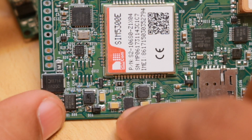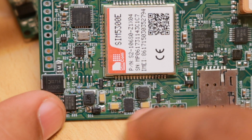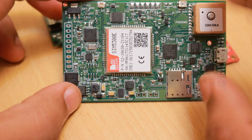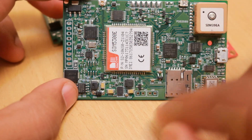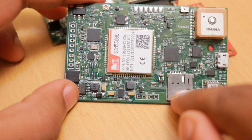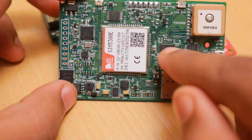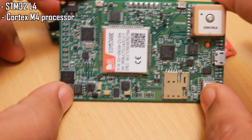This is the battery charger which I used in my Wildtrack V2 GPS tracker. We are feeding 5 volts to this charger chip; it will charge the battery connected here and in parallel it will be powering the whole system. We have also used a push-push type SIM card instead of the push-pull type, which is very useful when putting it inside an enclosure — you can directly insert the SIM card from outside the casing.